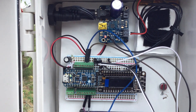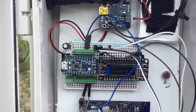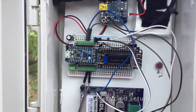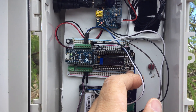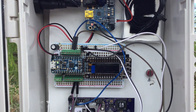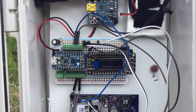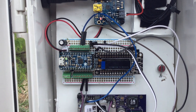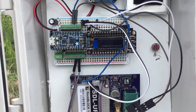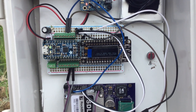The Arduino is blinking, which means we do have connection. The display was installed upside down on this one, so I've already made a note that that needs to be fixed in our standard operating procedure. It's in the loop and it's going to try to talk to the RockBlock. It takes a second because it's got to charge that 5-volt capacitor, so I give it a little bit of time — that's what the 'this takes a minute' message is all about.